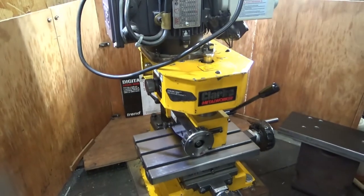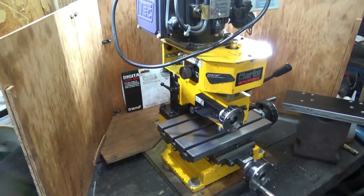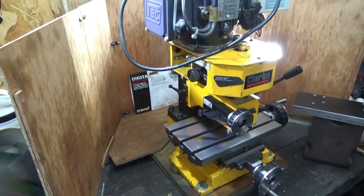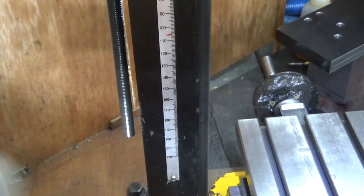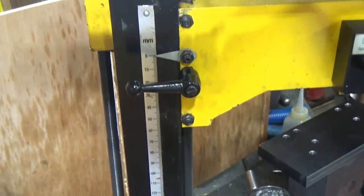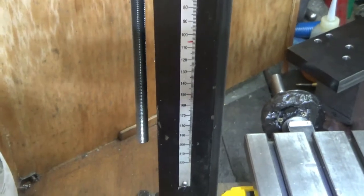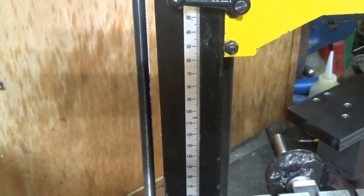What will it end up like? I think I'm going to have to extend the lead screw. So I will do that in this fashion. I think we can get a good look at the lead screw there, and as you can see, that lead screw is that length, and that is it. I don't see as though I can get any more out of that by extending the top. I need more threads, simple as. So that might be the first ball screw I go for.